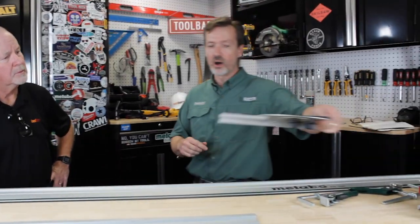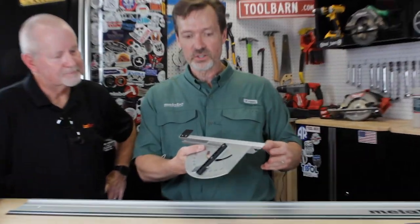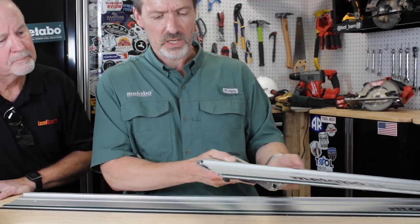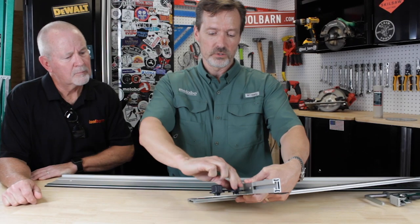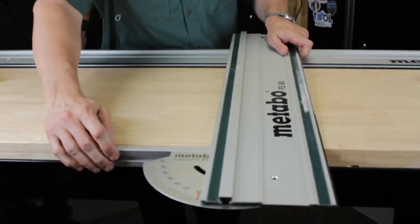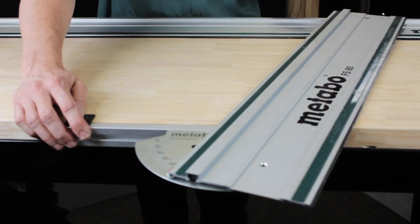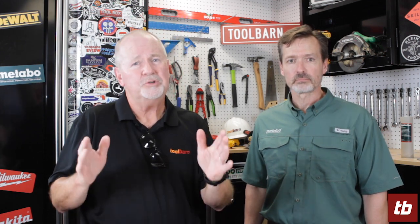This miter attachment also comes in handy because we're not always cutting at a right angle. It slides into the same rail that the clamp did. On the back side there are two knobs — this is the pivot point. Just tighten that down and you can set whatever angle you want. For instance, if this were a sheet of plywood, you lay it like so, put the angle on it — 20 degrees — pop it in at 20 degrees and mount your saw. We've got all these things at ToolBarn.com. If you're interested in Metabo tools, we've got what you need there. Thanks for joining us and we hope you'll be with us next time.